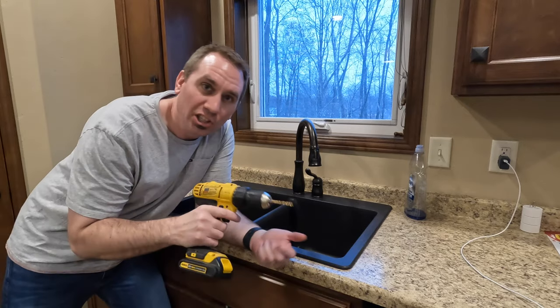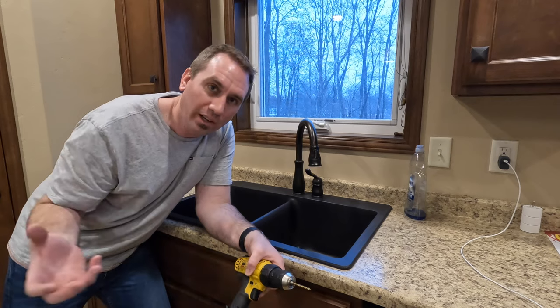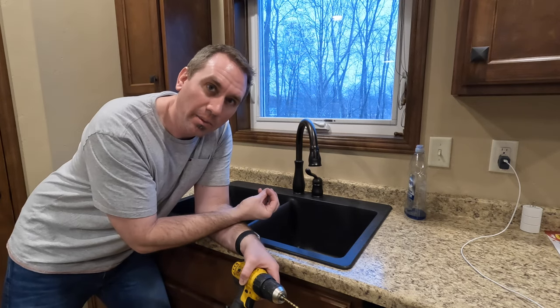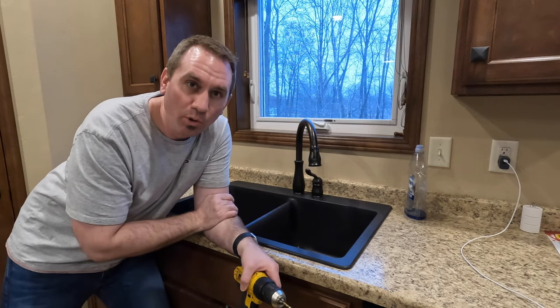So what I'm going to use — actually, you can drill through it. Ideally you'd use a hole saw that's the correct size. Use the knockout in the bottom as your pilot, put your hole saw in there, and just make a nice smooth hole through it.